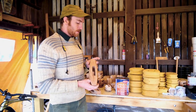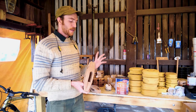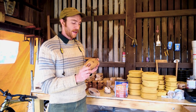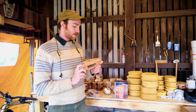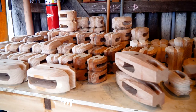The live oak is less stable than ash and Osage, which is why we're not using it everywhere, and it's really heavy. However, live oak is not prone to splitting — it has such a mixed and interwoven grain, like a lot of oak but especially live oak, making it very durable in that way.